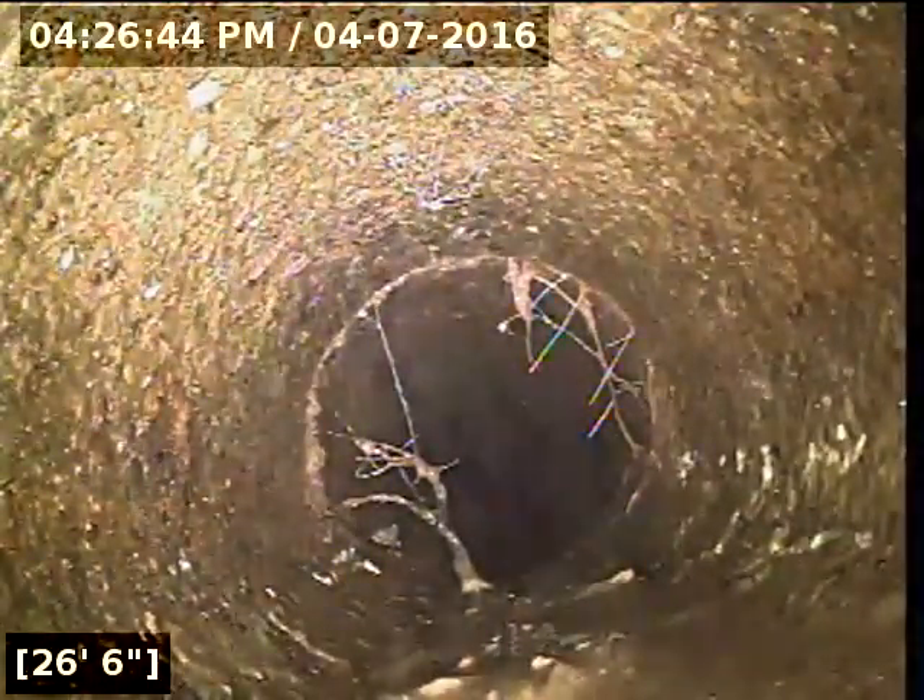I'll do a white T marking here. It's about five to six feet out from the foundation at that T marking, about three feet deep there. Standing water starts right here at 20 feet. I took the white paint markings all the way back to the foundation of the house — that's pretty much where the belly starts, at the foundation. Start the repair there, and that will correct the roots as well as the belly.